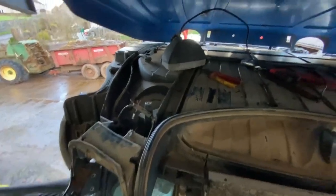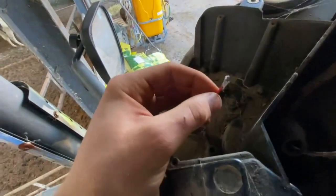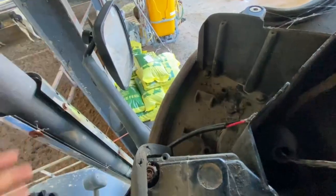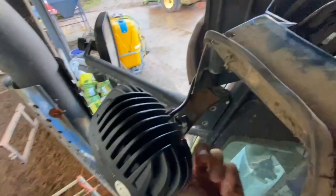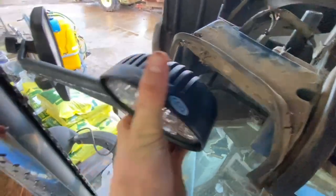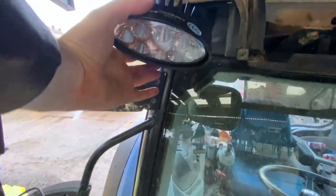So I've got one of the old work lights off, just need to get the other one off. You can see the proper old fashioned square halogen things - I don't know why someone's decided to put them on the tractor. I'm just on stripping the wires away to fit them now. I've already stripped the old wires down, just need to do a bit more stripping because they were soldered on the ends. I need to straighten out this bar because the old work lights had a swivel on the back, so I'm going to have to straighten this bar so these sit level - otherwise when I tighten them up they're going to sit on an angle.